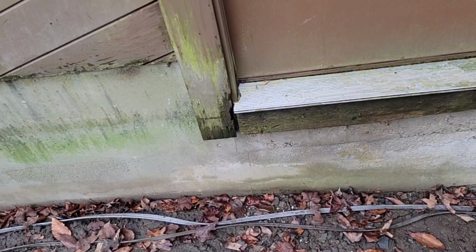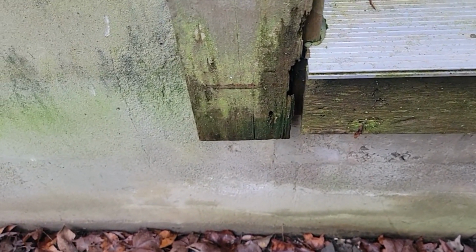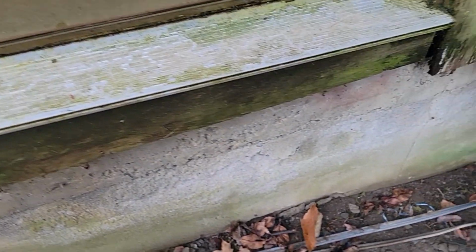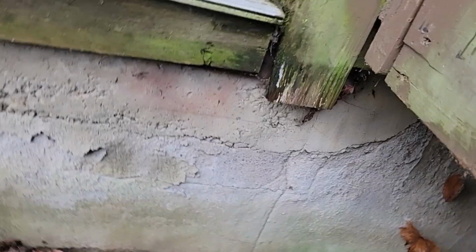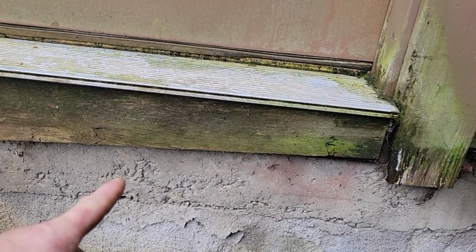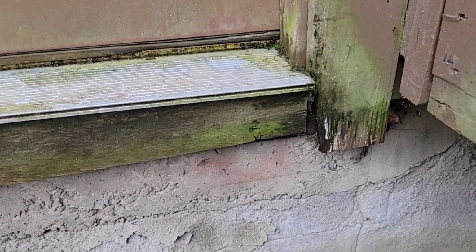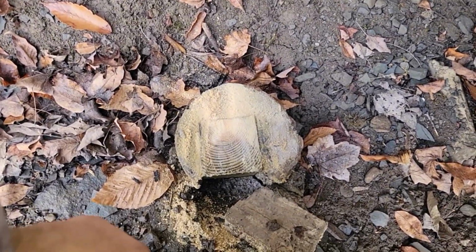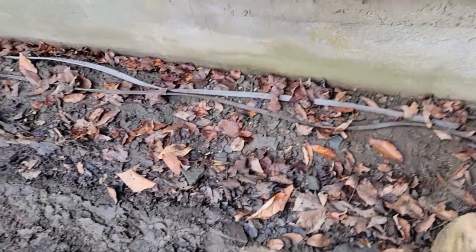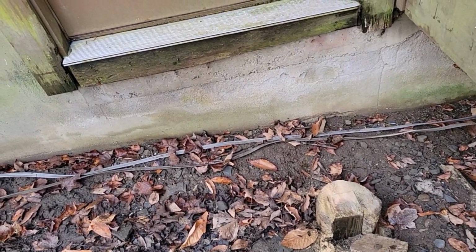And it seems like around this door, this is cedar, but we got a little bit of rot down below the door frame. Concrete's up here. It's a concrete floor in there. So I'll probably be cutting them off and or replacing them, taking off this little fascia skirt board and replacing that. And it looks like there's one more underneath it. I just want that better. And this post here is probably not in the way. I can just go over top of it. You always want the slope on your building to go away from it, so I'll probably be putting a little gravel under there anyway.